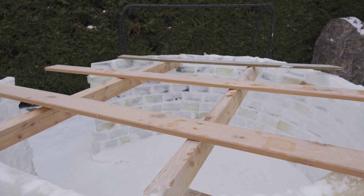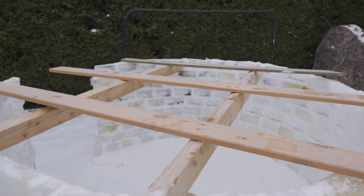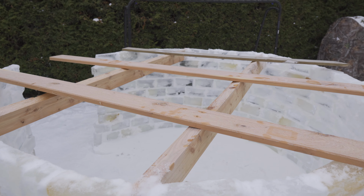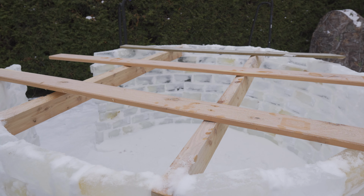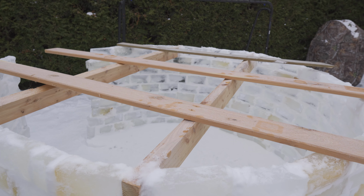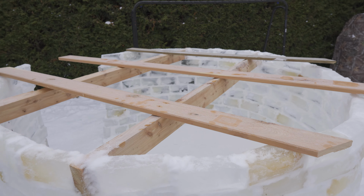So I'm going to cut the roofing felt. I hope I got enough, and I think I would put 3 stripes overlapping on each other. But I'm wondering if I have to remove the foil, because it won't stick to anything. So probably I would leave the foil, or maybe on the top layer, which is overlapping the other two, I would remove the foil and let it glue, but probably it won't glue because the temperature is below zero. And if you remove the foil, it stinks, so I probably wouldn't. I will see, and then I would put some snow on top of the roofing felt, I guess, to keep it in place. I won't be attaching. I can attach it with the nail gun, but I think there is no use. It's better to just weigh it down with snow or maybe bricks, and that's it.